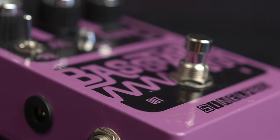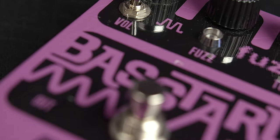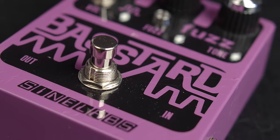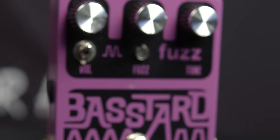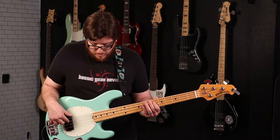Let's see what the official word is on the Bass-terd from Sine Labs themselves. It's powered by three meaty BC549C transistors. It's a reproduction of the Vox Mastermind Dick Denny designed ColorSound bass fuzz, with the addition of a switch to use different clipping diode options. You flip it up, it's silicon; flip it down, it's germanium; and leave it in the middle for no clipping diodes.